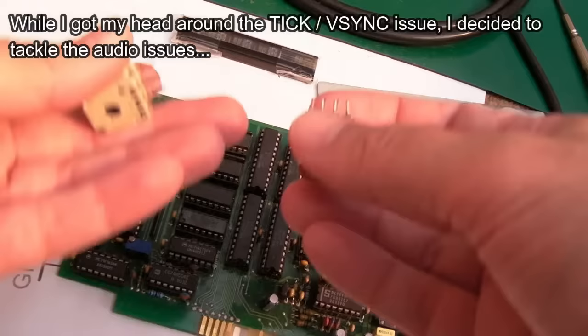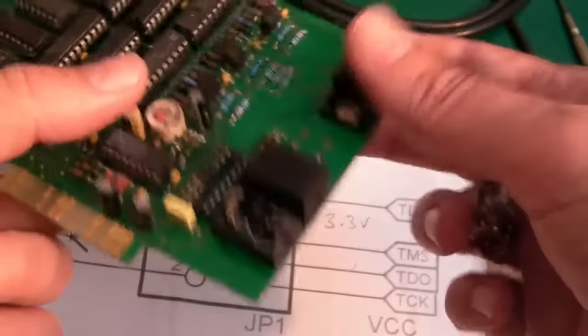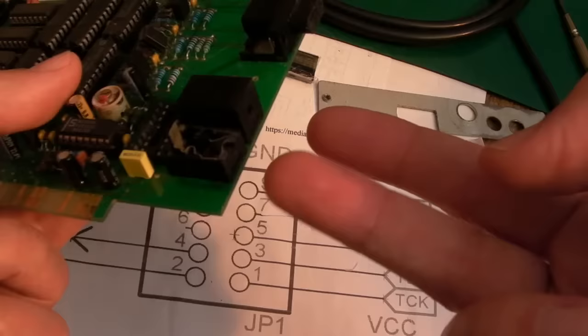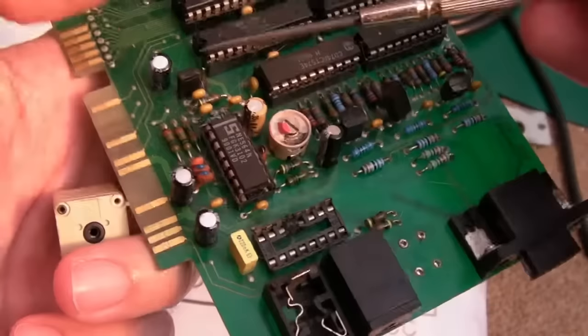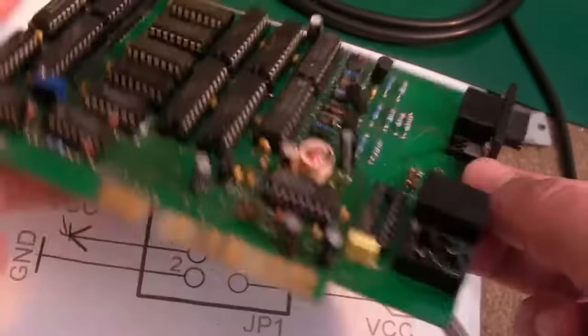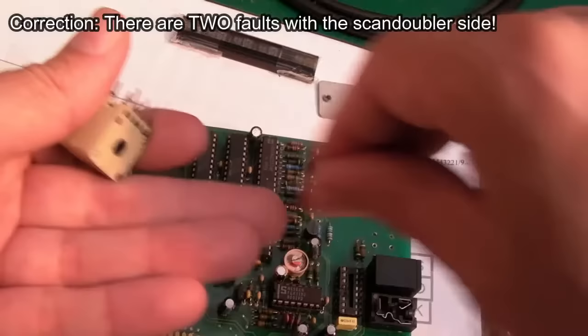The postman has just been and I've got a replacement potentiometer. I removed the original earlier for the audio. I've also got a cable for this — I was going to replace the 3.5mm jacks but I don't see any point since they're functional. These are mono 3.5mm jacks — left and right channels come out here, tapping audio off the connector, going into the audio amp. I'll get that old socket off since it's mangled and put a new one on. I need to mark the tops of these caps but it's been through the ultrasonic — that's why they're not marked anymore.